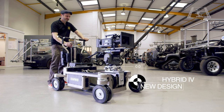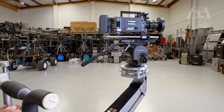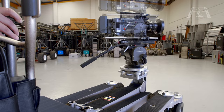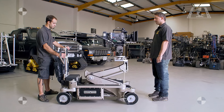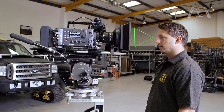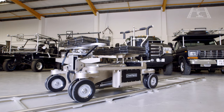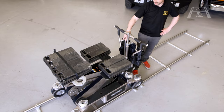The most significant feature of any Chapman Leonard dolly is the hydraulic lifting arm. Smooth and silent, it allows for a dynamic change in lens height during a shot, or to position the camera in a secure locked-off position at different heights. The hydraulic arm has now been perfected to move in a perfectly straight vertical line, eliminating the need to pull focus on a camera move ending with a close-up. The lifting capacity of the Hybrid 4 arm has also been increased to carry up to 700 pounds, bringing it close to the performance of the larger Hustler dolly in terms of its ability to cope with large camera packages.